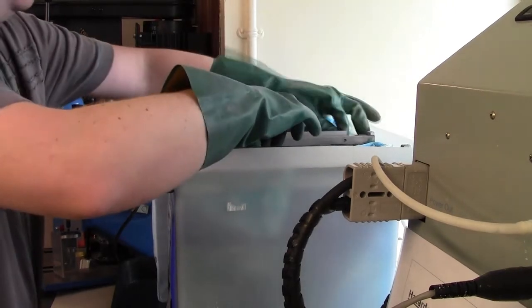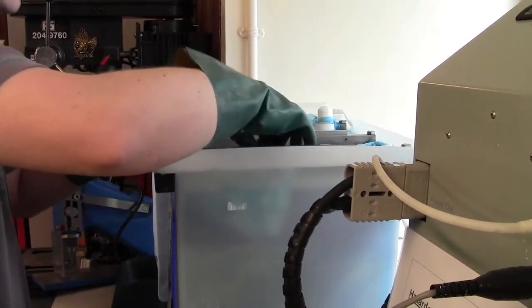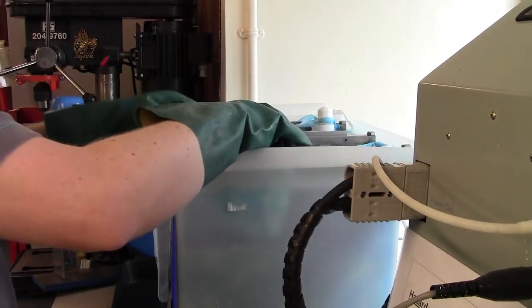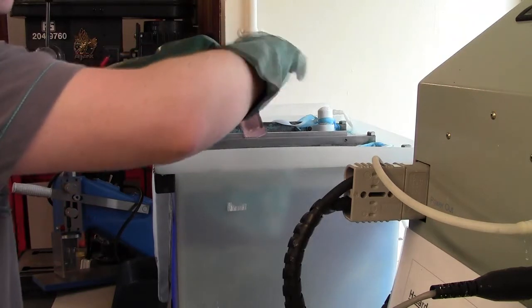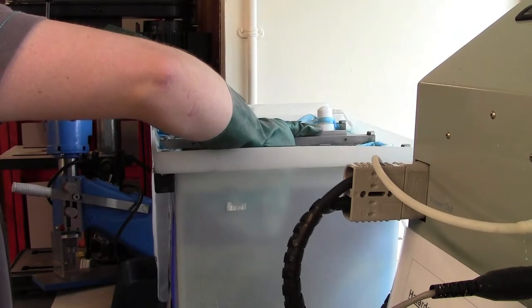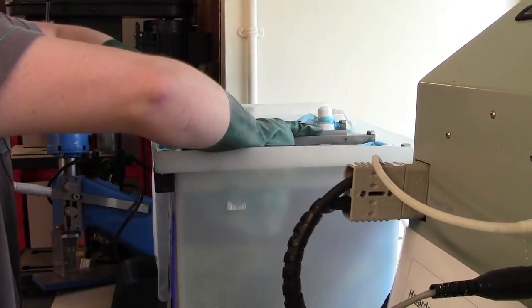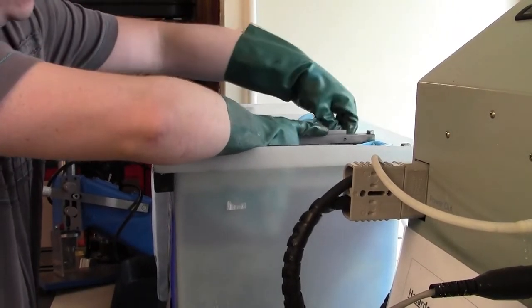Open up the clamp. You can get tanks or do-it-yourself kits that use hooks or clips. Some of them use crocodile clips, some use hooks. They don't work too well because you don't get an even surface current developed across the board, because you're only clamping the board in one or two places, usually the corners. And it gets clamped into there.